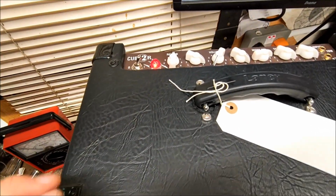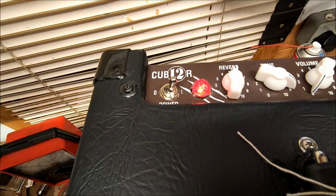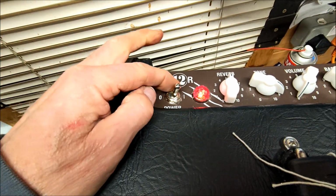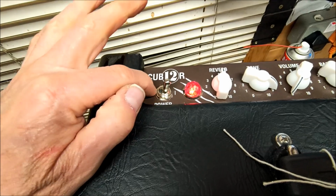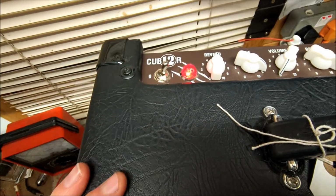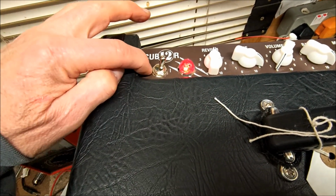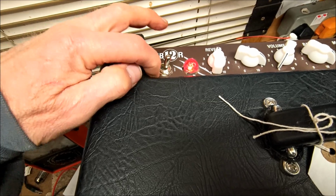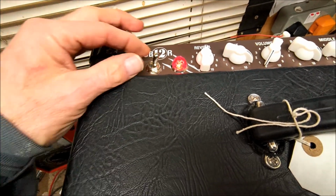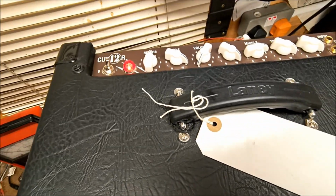One other fault I noticed when I was putting this back together and doing some testing was that the main switch itself, because again the plastic coating, wasn't actually connected to ground. So I've again had to scrape away paint and put a little serrated washer underneath. I wouldn't like that to become live, but other than that, it all seems good.